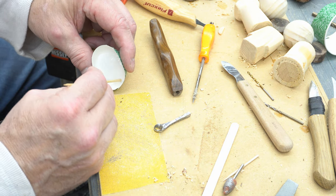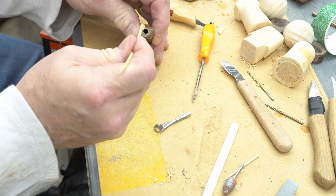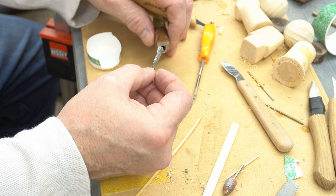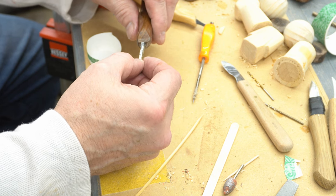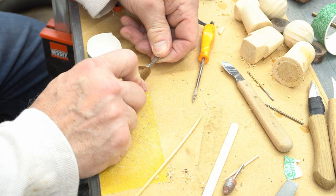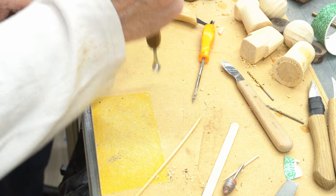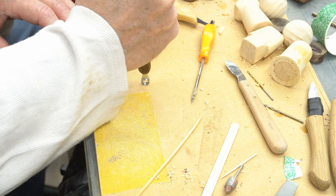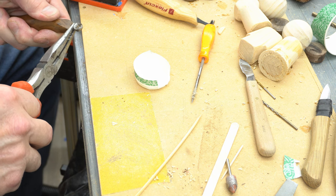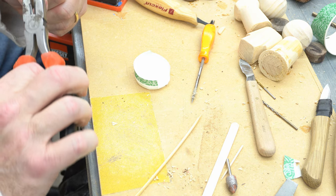It didn't take a lot of epoxy to fill the small hole and then lock in the steel shaft. The rough grinding wheel that I used, along with the square profile of the shaft, should lock into the drill hole pretty nicely and prevent turning of the cutting head inside the handle. That's the plan anyway — I guess we'll see during testing. It took a little extra persuasion to get the shaft down into the handle, but no real problem. After a little friendly pounding on the work table, I needed to adjust the angle of the cutting head just a little to align it squarely to the handle. Now it just needed to sit undisturbed for 24 hours to finally cure.